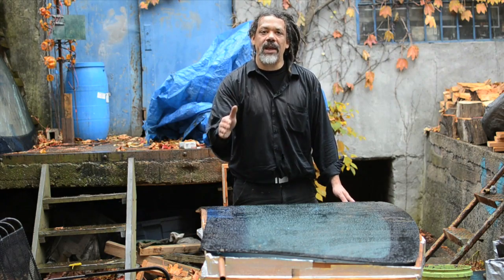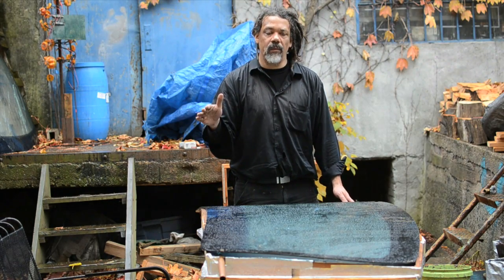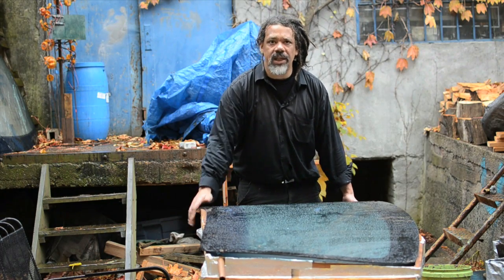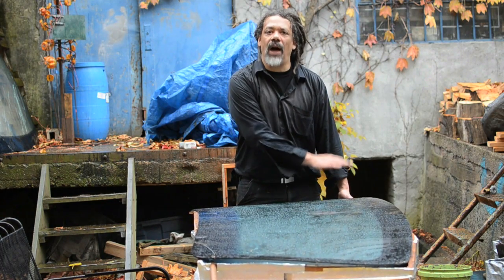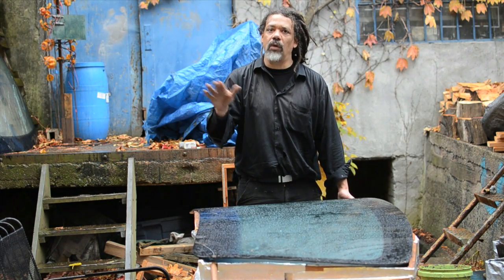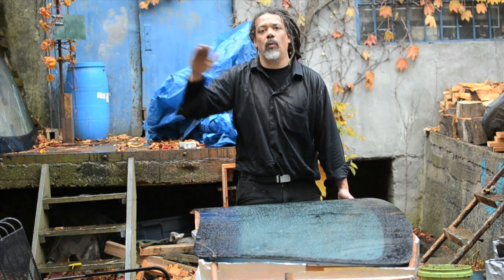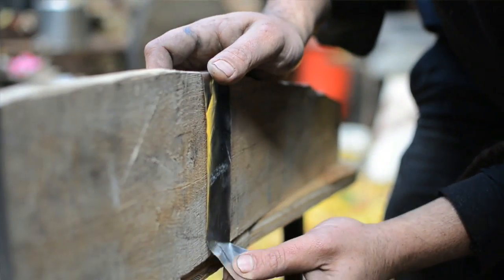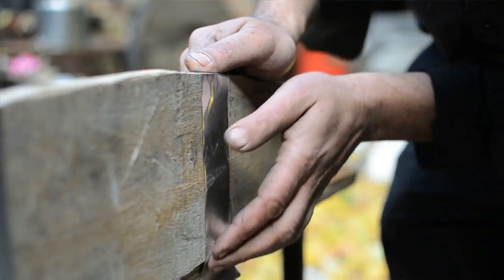The gutter needs to be placed on the downhill side of the still. Which side is the downhill side? It's the side that you put the gutter on. Gutter on this side — make sure that you tilt the other side of the still up a little. It doesn't have to be much, just a degree or two, just enough so that the water tends in one direction. Tape and caulk down the windshield, seal up all gaps, all cracks, make sure everything is vaportight.